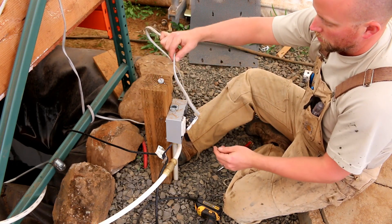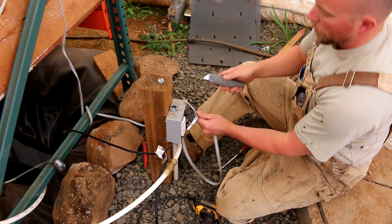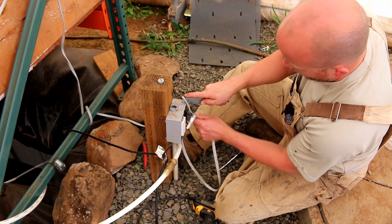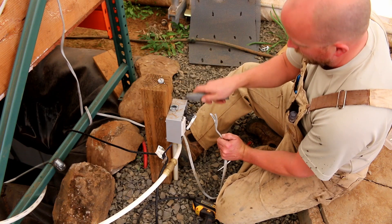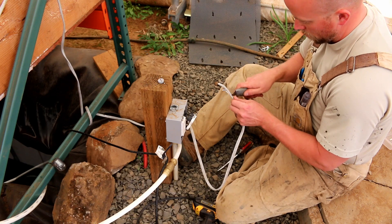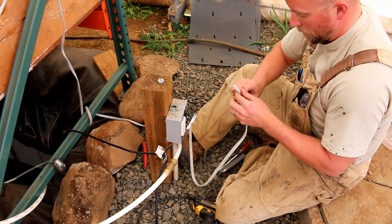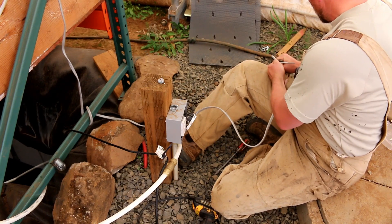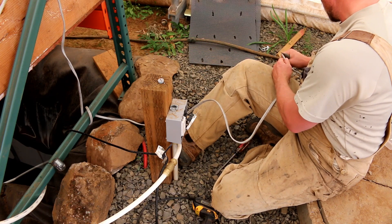The wire comes through there like that. I cut this with a razor blade knife with the blade constantly touching something so I can't slip and hit my hand — done that a few too many times. Then you still miss the copper here, so you got to whittle it. Always whittle away from you — learned that lesson the hard way as well.